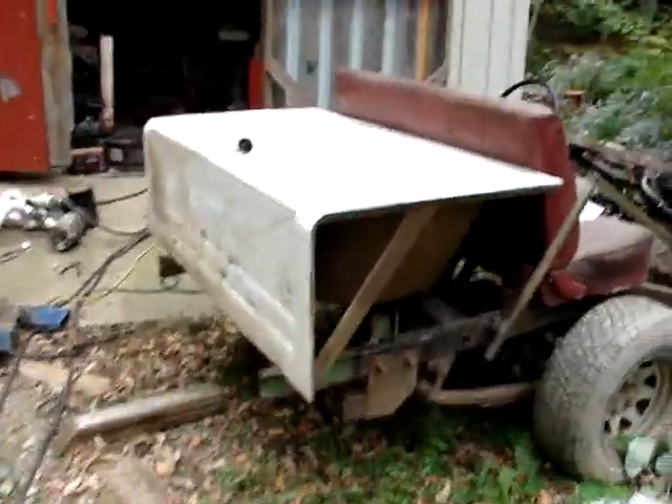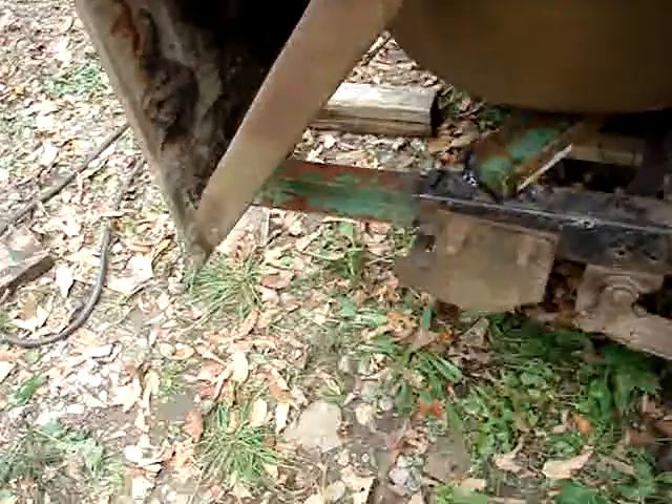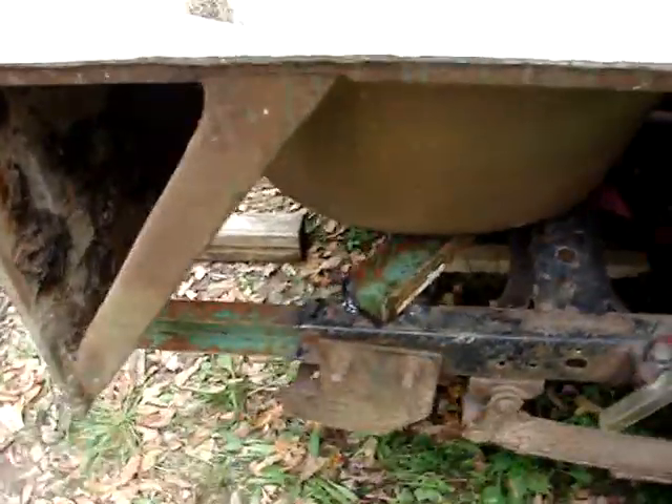We're making progress here. Put some three-inch channel in the frame, extended it out about ten inches or so, and a brace underneath this side holding that foot of this end of the tub, and then we're resting on the frame here. I tack welded it on — cast doesn't weld real well without nickel rod, but it'll hold for a while anyway. This side is actually lower the way the tub is cast so that it'll drain, so I just put a small block there to hold this end up, but I'm going to have to cut this bolt off — maybe the drain will fit in there.